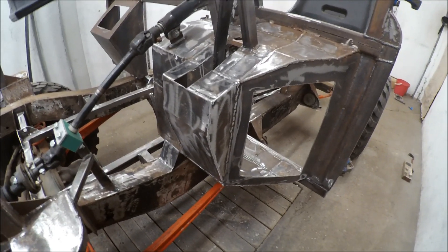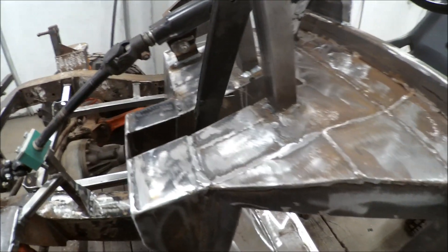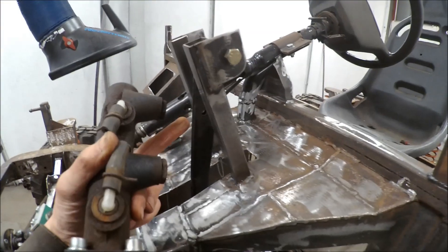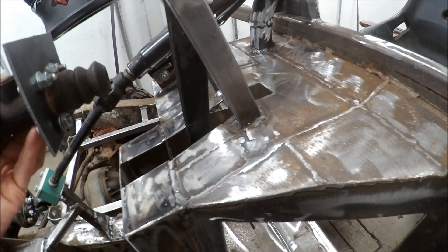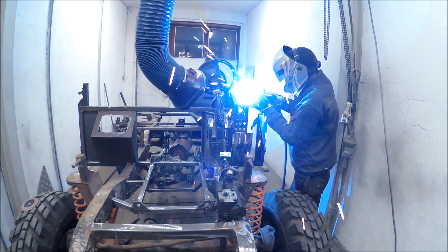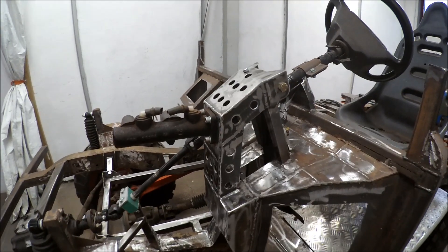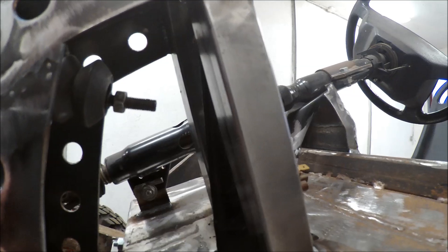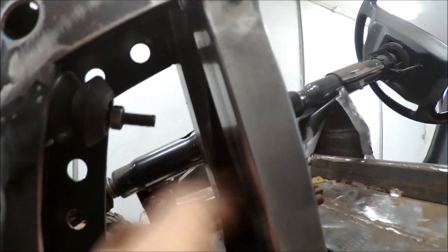Now the box is finished so I have the correct stroke for the main cylinder. I have the cylinder here and you can see the hole for the lever to be fitted — it comes somewhere around there. You can see the finished bracket for the main brake cylinder. Now I just have to make some kind of fitment between the piston from the main cylinder and the brake pedal. I think I can find some OEM parts in my storage.